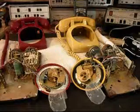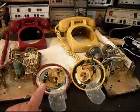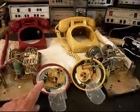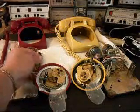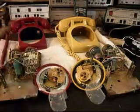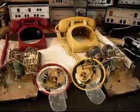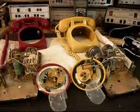Okay, we're back now, and we're going to show a little bit about what's going on. We're into the rotaries of both telephones, and we're oiling, cleaning, and adjusting these rotaries. And we want to make sure that they're dialing properly. We're also finding a few things that are wrong. We have a wire here that has been broken off. And so there's some various issues along with the repair of these telephones. We're finding little things here and there, and we want to get all that repaired up.